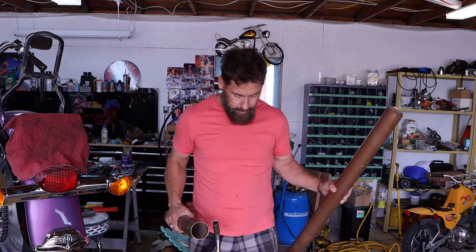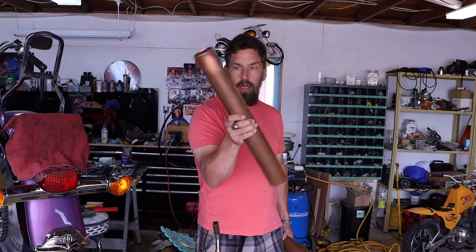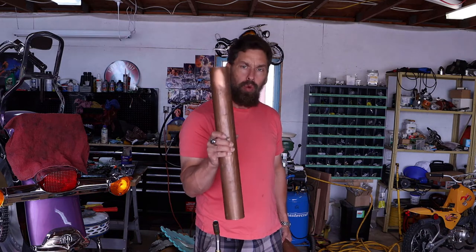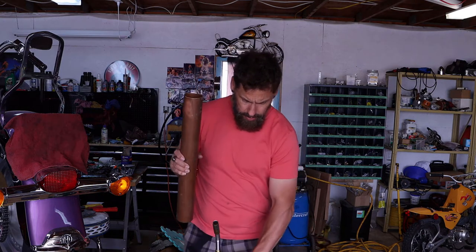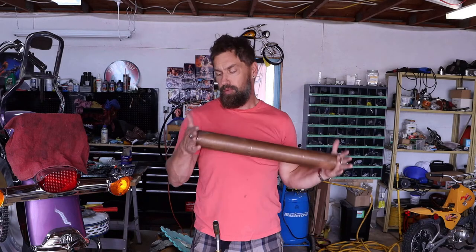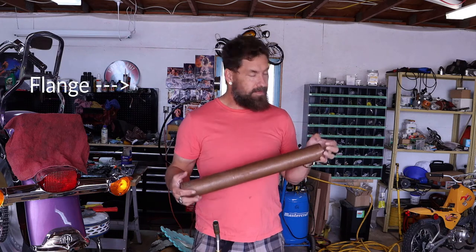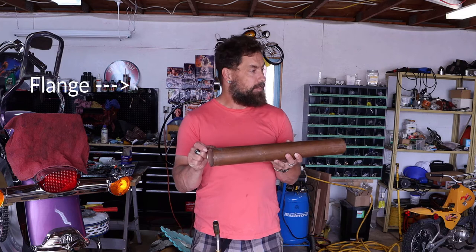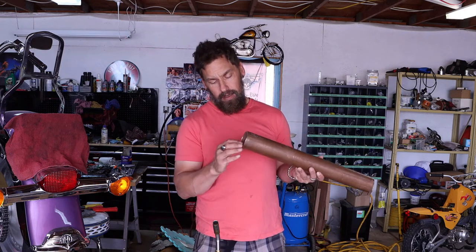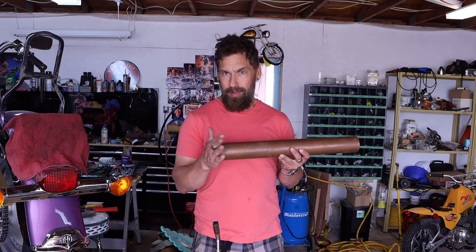So here we are back. Okay, so this is going to be my product condenser. This is 21 1/4 inches, I believe it is, because I want to put tri-clamps on this. So put ferrules in here, tri-clamps, and so I needed room for the shelf of that ferrule end to slide inside here. Because it's K, so it's really thick, I may have to pound them in or tap them in anyways.